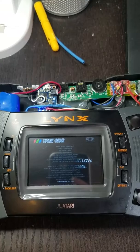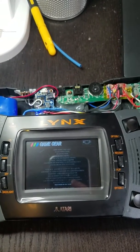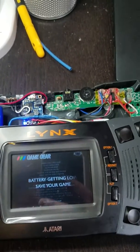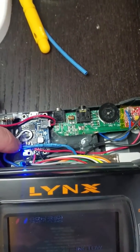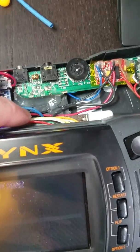I modified the script because it's also designed to do a safe shutdown on the power switch, which I don't have all the components to build. So for now I'm just using a standard power switch, but I basically just wired up 500 ohms of resistance between the LBO pin on the power boost and GPIO 21.